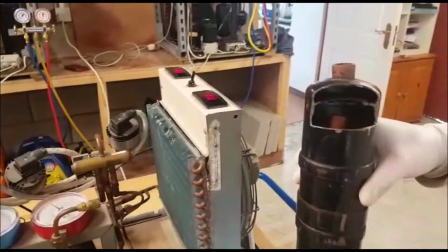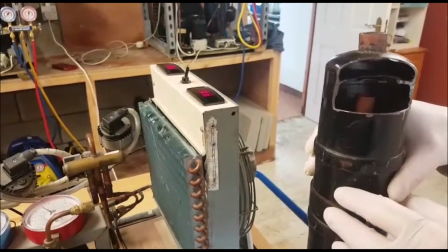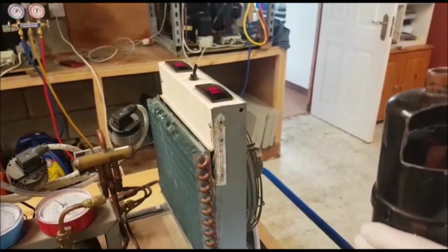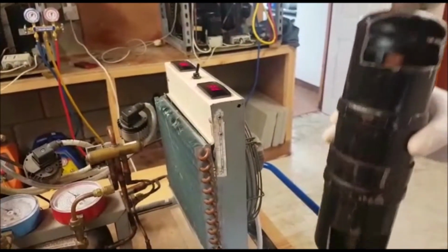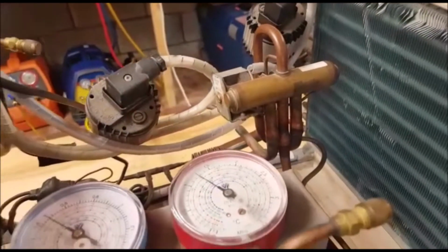That's its primary role. A secondary role it has is that when you're pumping down your heat pump, you're actually pumping it down to the suction accumulator. Unlike commercial refrigeration systems, but I won't go into that, I'll explain that on another day. But we know how commercial refrigeration systems work with high side liquid receivers. Okay, the four-way valve is in cooling mode. Next we'll energize this solenoid and we'll show you then what's happening with the refrigerant.